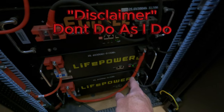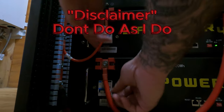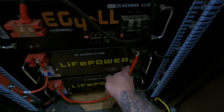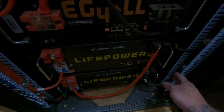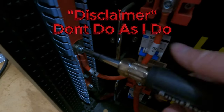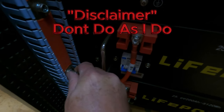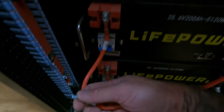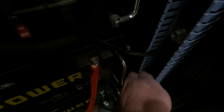I'm going to kill the power on these two right here. Now you can see the power is off on these two batteries. Let me get my tools and unscrew this and unhook them from the bus bar. I probably wouldn't touch anything else with this screwdriver — this is not the safest thing to be doing, just so you know. That bus bar is live right there, so I need to put it out of the way and tape around it.